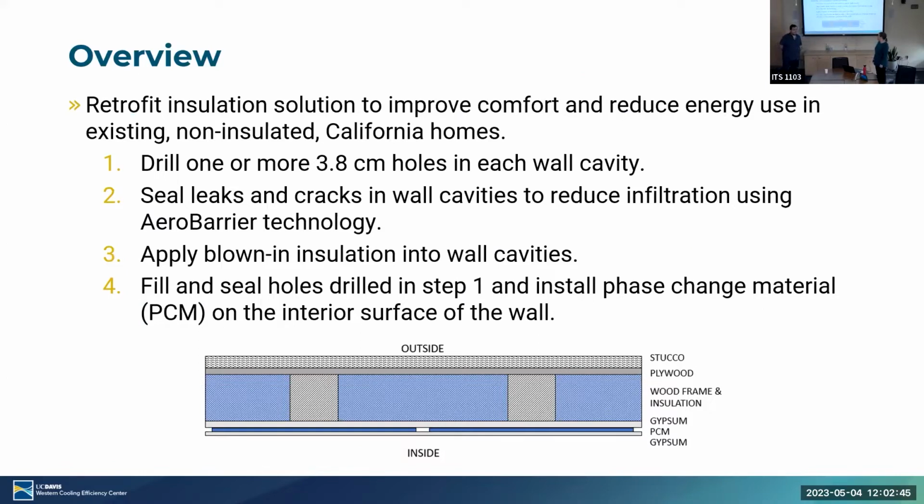This was a project sponsored by the California Energy Commission, and the goal of the project was to come up with a retrofit solution for residential homes that are older and were built without insulated walls. This was standard practice prior to about 1978, when the energy standards went into effect requiring insulation of walls. So basically you have some exterior siding like stucco, generally perhaps a layer of plywood, some wood studs, normally 2x4s, we're showing 4x4s here, and then an empty air cavity, and then some gypsum drywall on the inside wall.